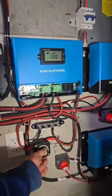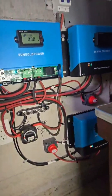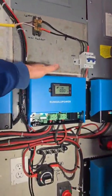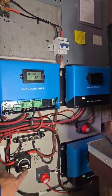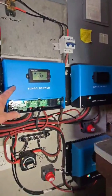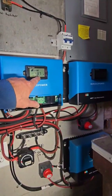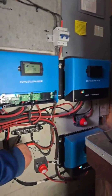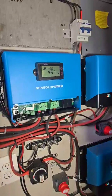Let's put this over to combo — choosing solar and water wheel together. I think these charge controllers take about 75 volts to kick on, and it just clicked over, so now it's running on solar amperage to power the controller and turn it on. But we're not getting anything more than what we had before with just solar alone.